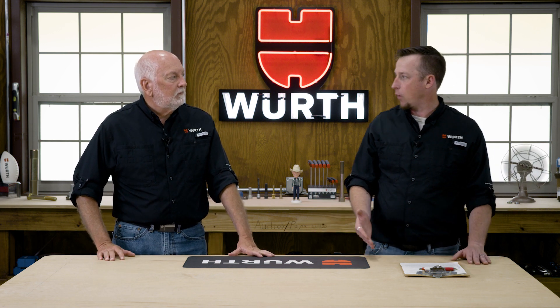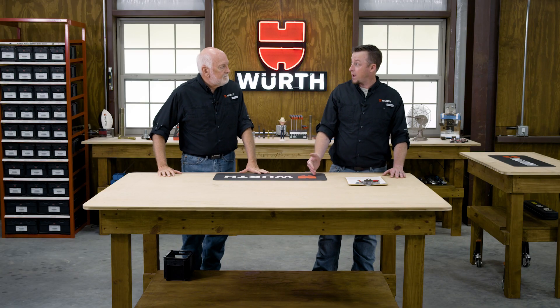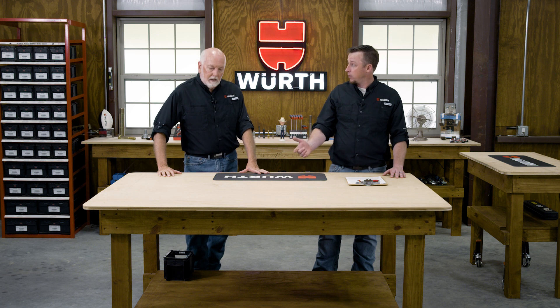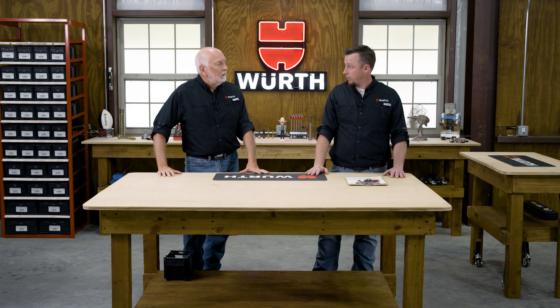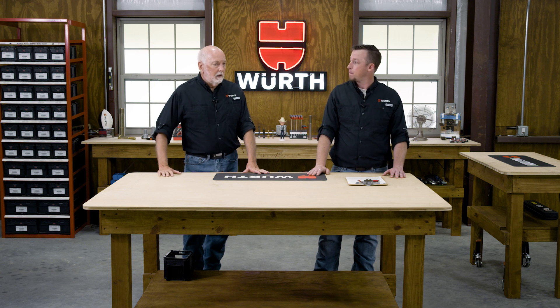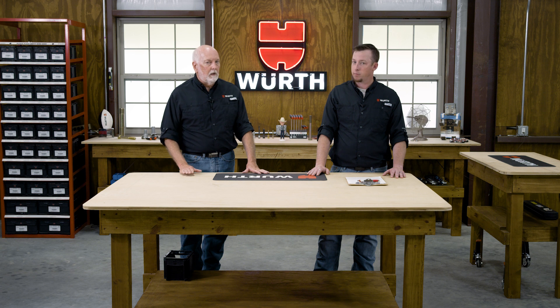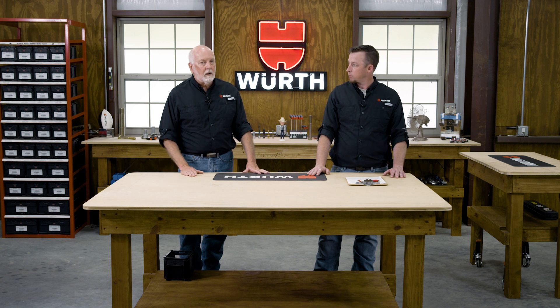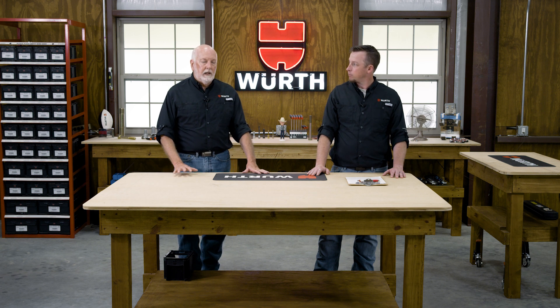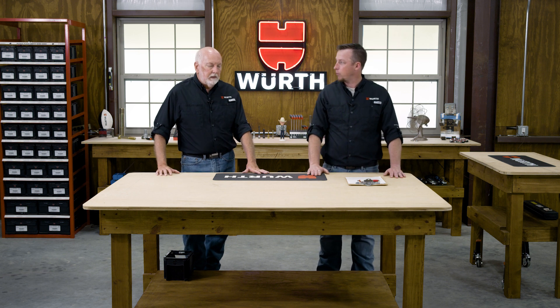The advantages outweigh a lot of these challenges. We've got high corrosion resistance — 240 hours plus — and it's environmentally sound. Global availability is a big one: these applicators are available globally, so you can reference the ASTM and ISO specifications and get product done globally. There is some quality difference among applicators, so we keep a very close eye on that to make sure they have the correct equipment — licensed applicators for sure.